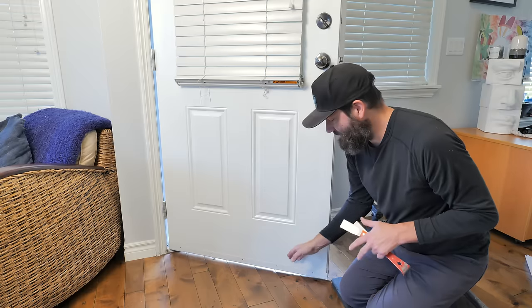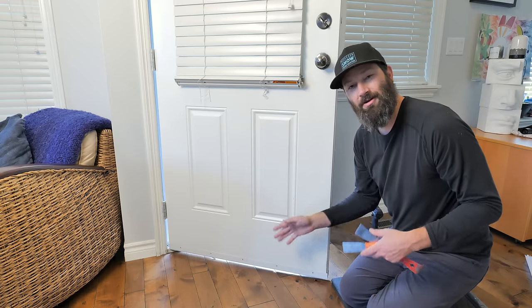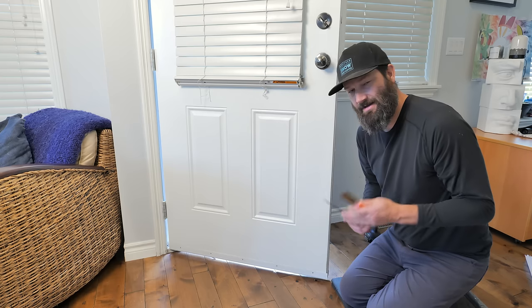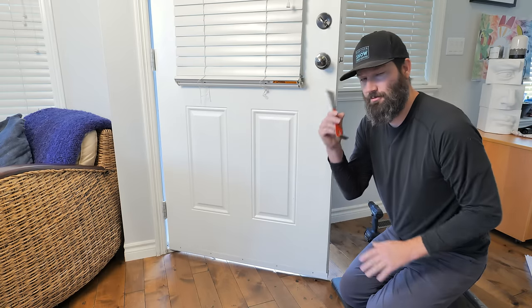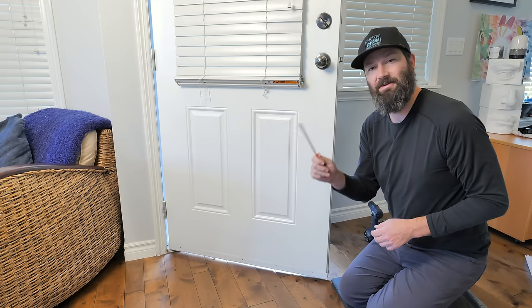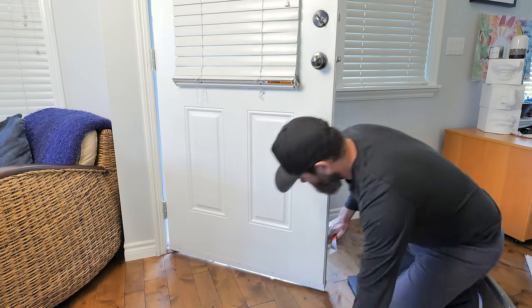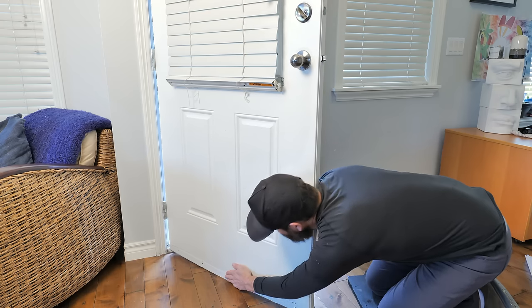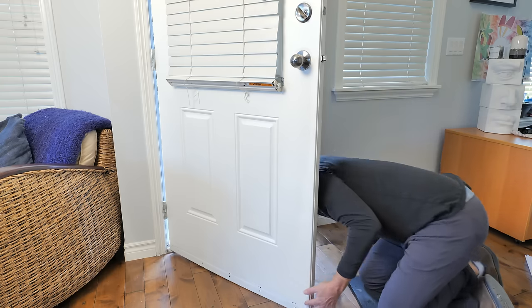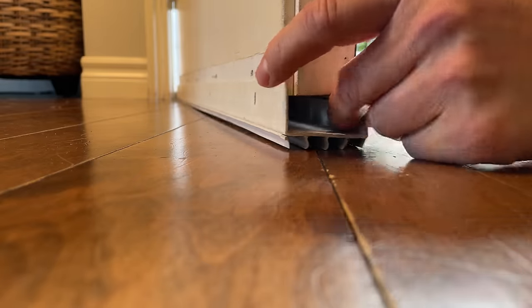Now the screws are out. When it comes to pulling off the sweep, a lot of times the door may have been painted or there's residue built up — they're often stuck on. Take a little putty knife or one of my favorites, the Richards Red Bar. There's an Amazon knockoff version too — I'll link them in the description. Get your implement in there and break it loose. Push the sweep all the way down before you try to slide it off, then just pull it right off along the door.